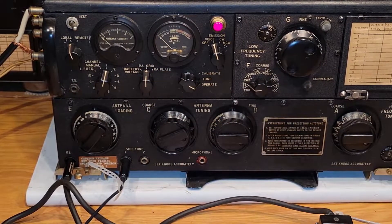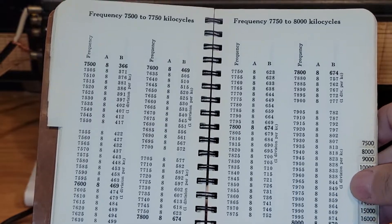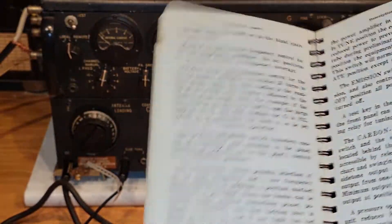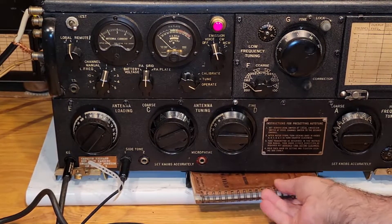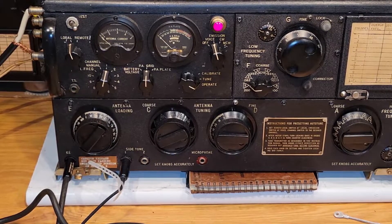So that was that problem — control C had to be lined up. Clearly there's a ton more for me to learn and understand about this transmitter. It's still a bit of a mystery to me, but I'm going to continue to look through the manual. It even comes with this nice little handbook that tells you exactly what frequency you want and how to set all the dial positions. To learn how to load up the antenna, I think the plate current is supposed to be dipped by adjusting the antenna loading and antenna tuning. More to come. Thanks a lot.